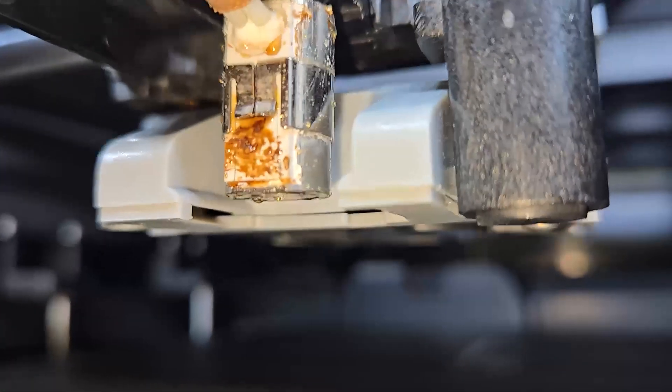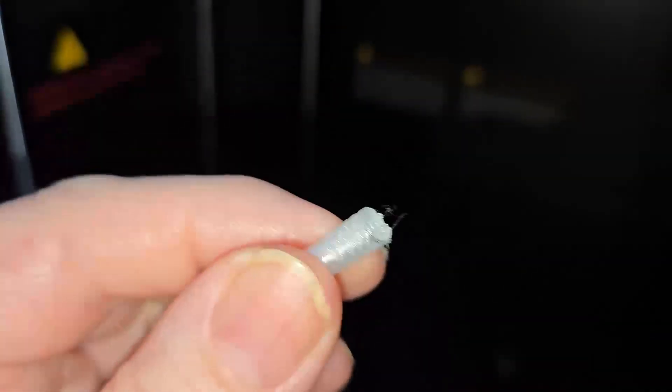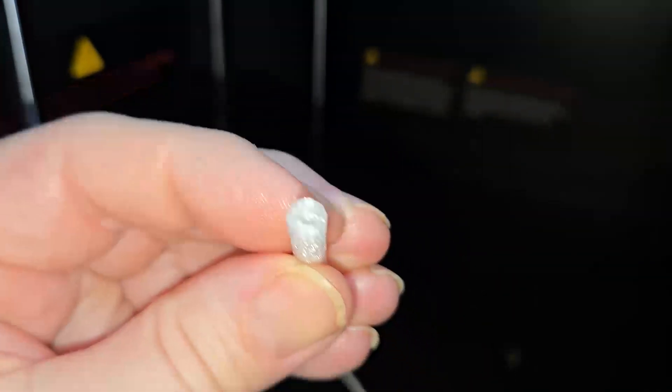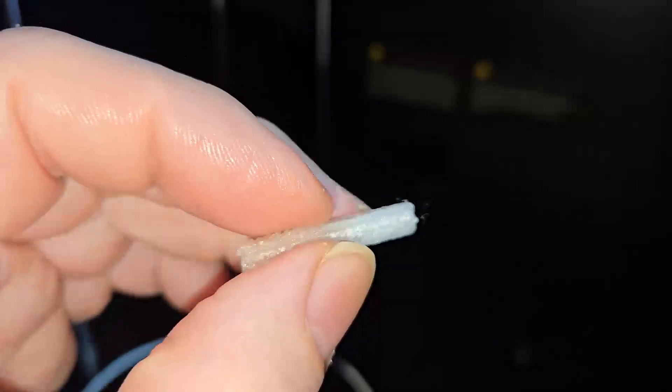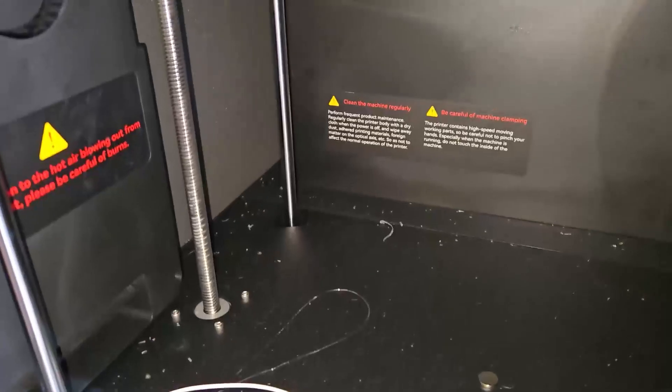You try to print like this? I did try many times. What ends up happening is part of your filament is still going out that gap, so you're dramatically under-extruded. These should have been perfect spacers, but you can see how gnarly and under-extruded they are. That's what was happening there.